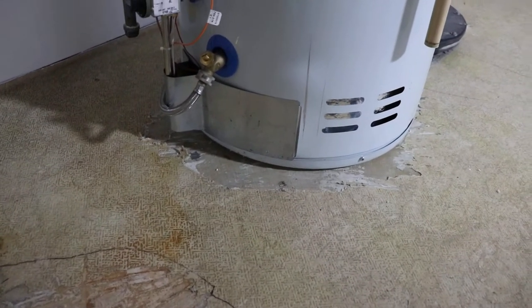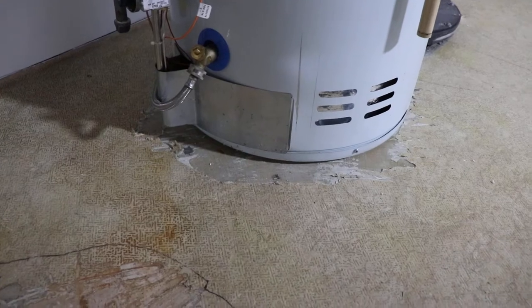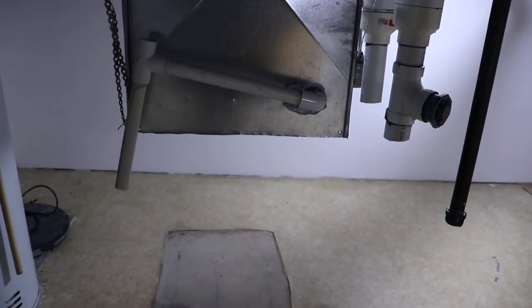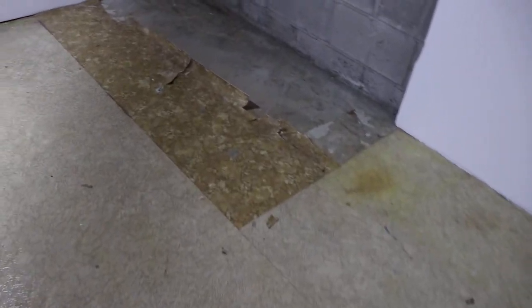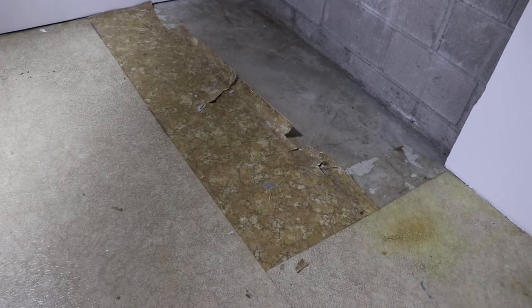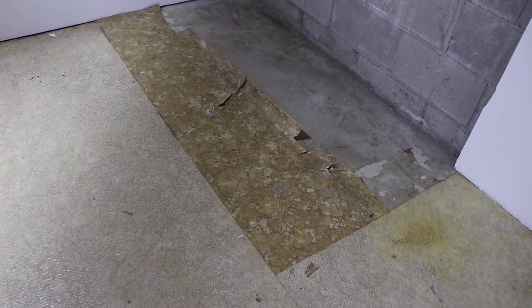You can see they went at it pretty hard trying to meet code — you're not supposed to put the oil burner on a combustible floor. The furnace wasn't so bad, but I had to take it out so we could remove all of it. That's the original furnace footprint; the most recent furnace was running sideways, which was a problem. There had to be an oil tank here too. I don't know why it's different linoleum, but that is also 50% asbestos.